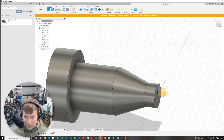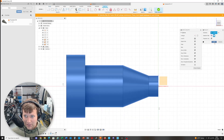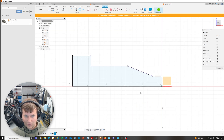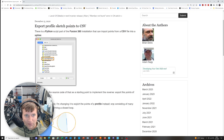Now I want to create a sketch on the XZ plane. I'll hit P to project and project that body, then hide the body. I'm going to start drawing lines — I only want half the part. I'll draw a line from there to there, delete the existing projected line, draw a new line, and fill in all these projected lines the same way. Now we have a closed sketch, which Fusion calls a profile — that's what we need for the script to run.